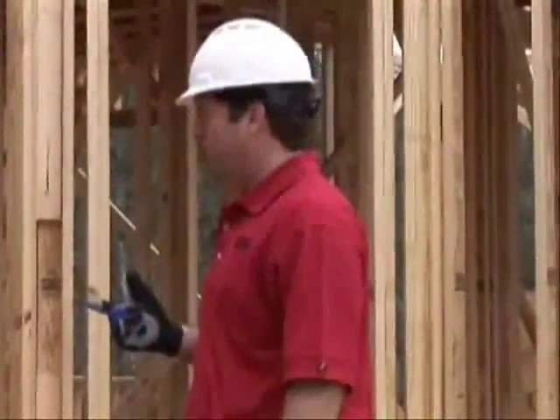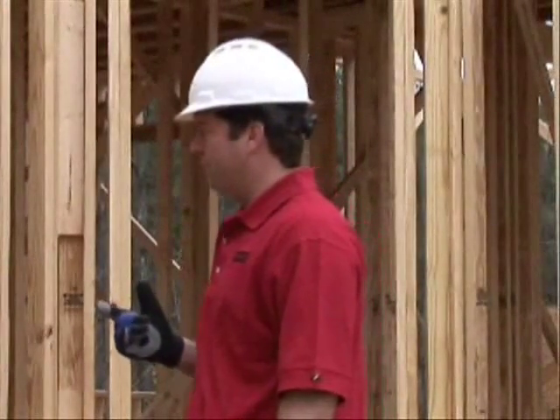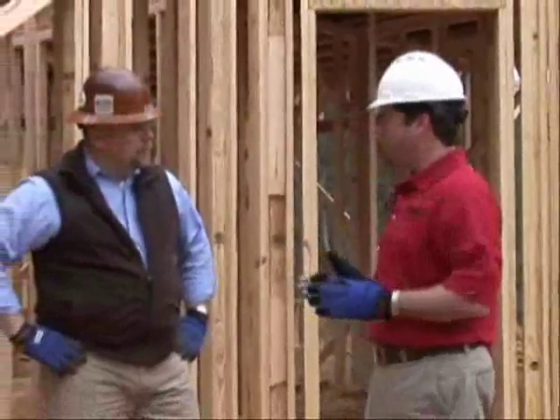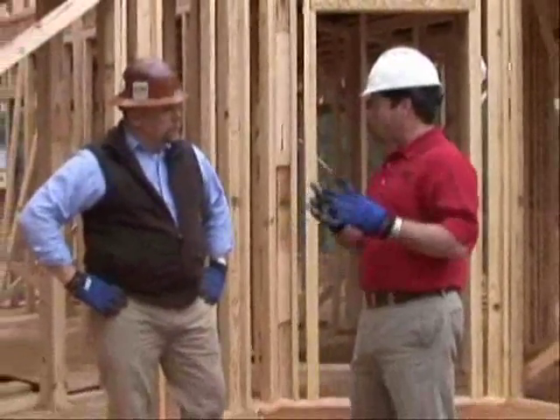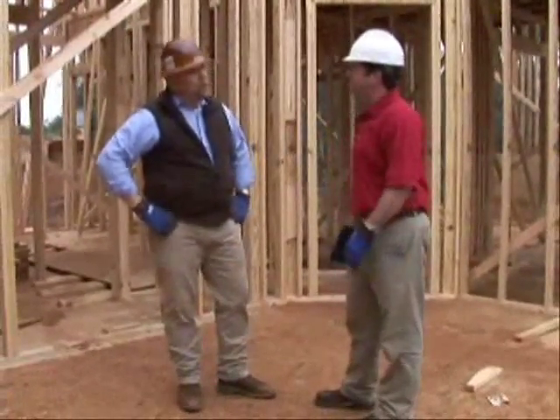Fortunately, in this product, you guys are accustomed to using I-joist. We have one rule in I-joist: you're two times the diameter of the largest hole away from it before you cut the next hole. So in this case, if you cut a four-inch hole, you need to be eight inches away from that four-inch hole before you cut the next four-inch hole.